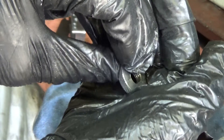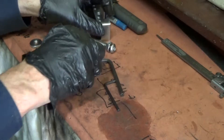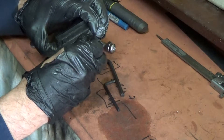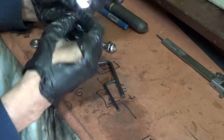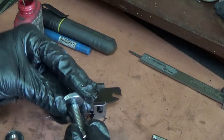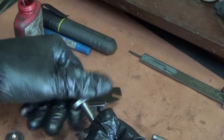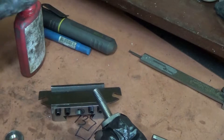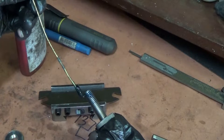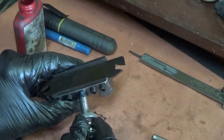Here's the finished item - looks pretty good. So I parted off another two. The job's all done and it's time to assemble - in with the set screws. I'm using an ordinary domed head Allen type bolt for the adjustment post, and I've got a nut already on it. The thumb wheel goes on with a little bit of Loctite because that adjustment post itself is not supposed to move, and we'll be all finished.